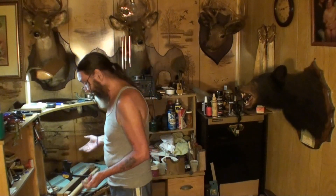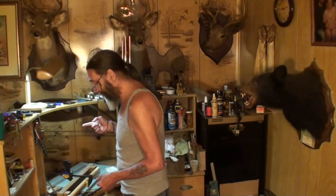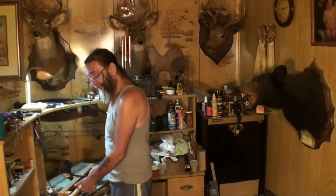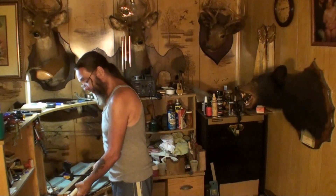I'm going to put it away two or three days and go some more with it. Because under string stress, if the truss rod holds back bow when I take all this stuff off, that's going to be perfect. Under string stress it's going to pull neck relief — forward bow — back into the neck. The ideal thing I'd like to achieve: when I send this neck back to the owner, I'd like to have back bow in the neck even under string stress. That way when he puts it on, strings it up, tunes it up, maybe you'll still have a little bit of back bow, or the stress will make it straight. The idea is to have either one of those so he can loosen the truss rod under string stress and achieve the neck relief desired. We'll leave it at least two days — 48 hours — and come back and check on it again.